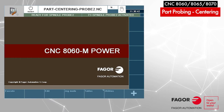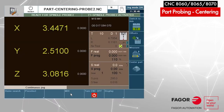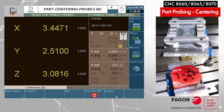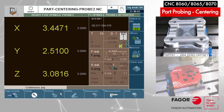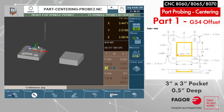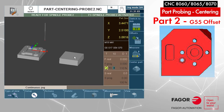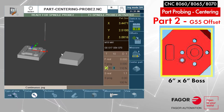From the main menu we go to jog mode. On our machine we have two parts already loaded. Part number one will be using G54 for the storage of the zero offset in the table. Part number two will be using G55 for the storage of the part zero data.